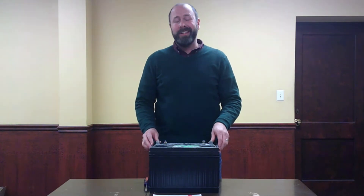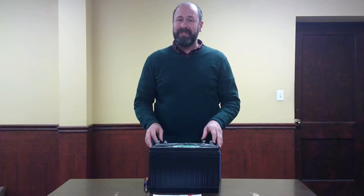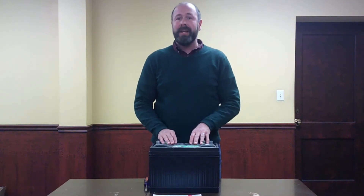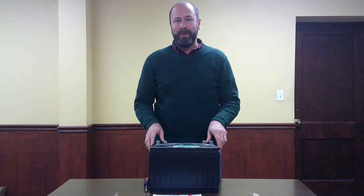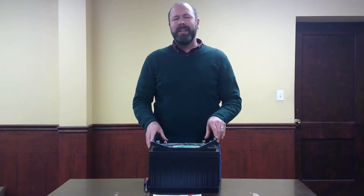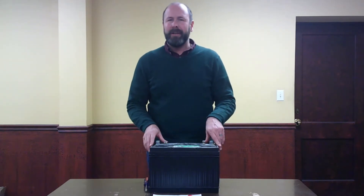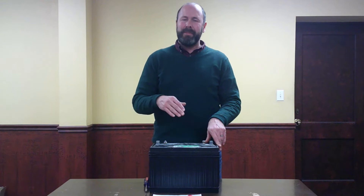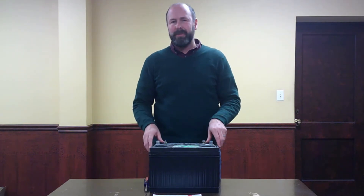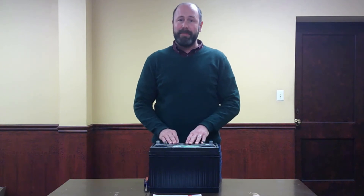Well, really it's a couple of things. One, there are some supply chain shortages going on right now, so it's very difficult to get some sizes of lead acid batteries as well as your AGM or maintenance-free batteries. Reason number two, probably about 90% of the calls I get on battery-powered equipment really goes back to the battery itself, not a mechanical issue on the scrubber or the sweeper or whatever it is. So it's really important to properly maintain these batteries.